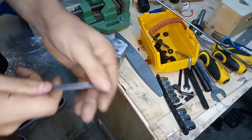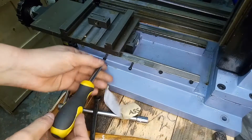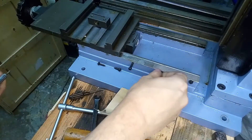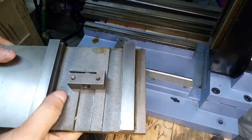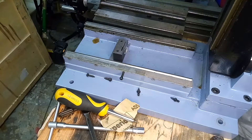This is the result — it looks very good and clean. I'm dismantling all the screws that hold the gib pressed on the dovetail, then I remove the Y axis. This is the underside of the Y axis, where we have the anti-backlash device.